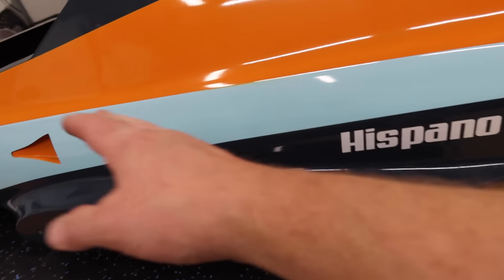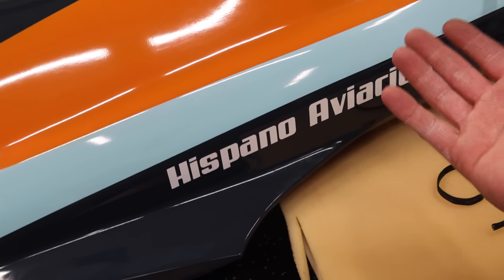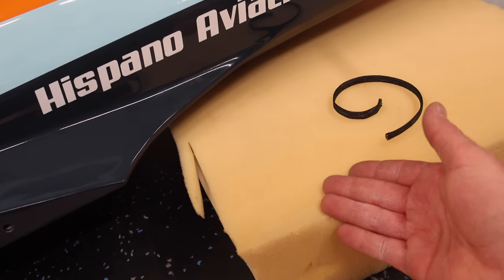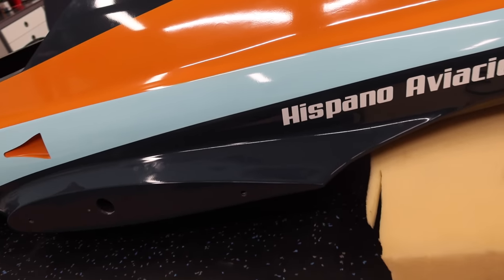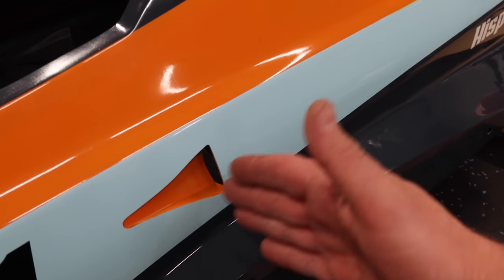With the amount of airflow going through these aircraft, heat's not a huge issue. So if your pipe is here and your wire is, you know, 4 or 5 inches away, you're usually going to be okay. There's no real reason to add a bunch of extra weight in these areas. I mean, maybe by the turbine you want to pay attention to that stuff.